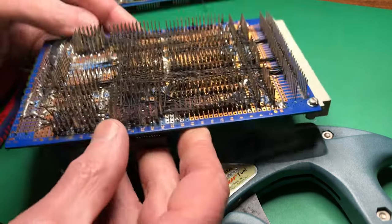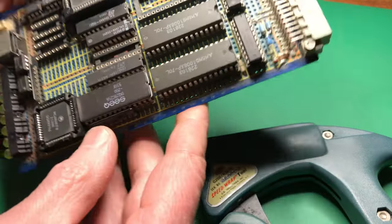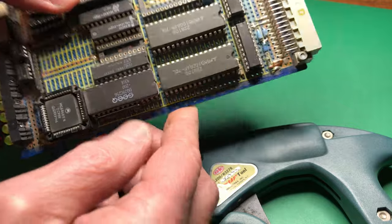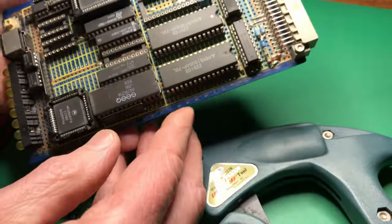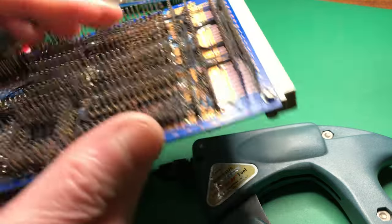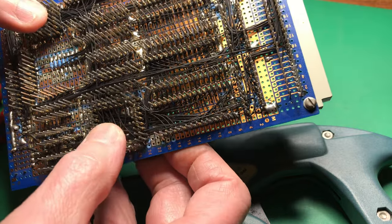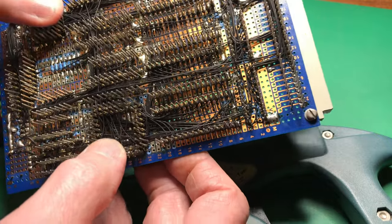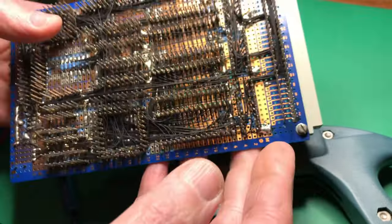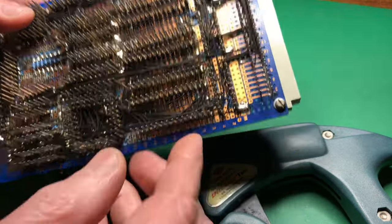That's an example of a prototype computer board built in the early 90s. The ICs are dated around 92, so it's probably about 92-93. You can see the fitting density for the parts. You can pretty much touch the sockets against each other on minimal spacing. The wire connections are direct pin to pin. There's no external space needed for tracks or pads to solder wires from above. It's just using a prototyping board that's got some power tracks built in for convenience to make short connections to. But other than that, all the connections are through wire wrap.